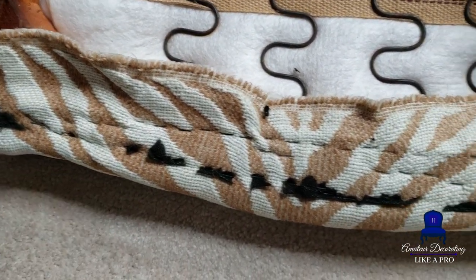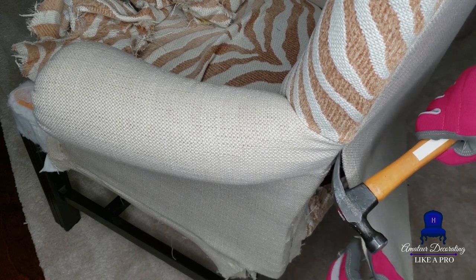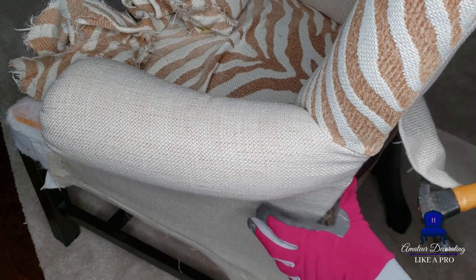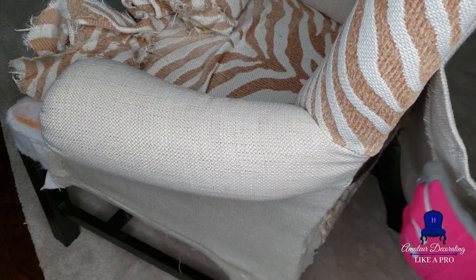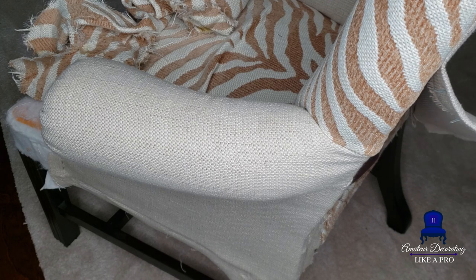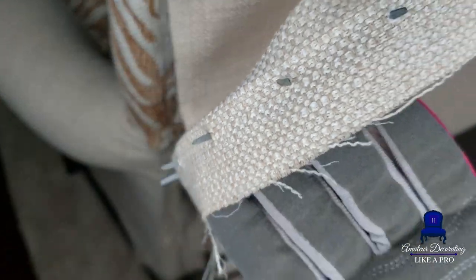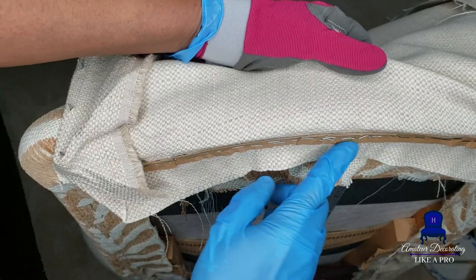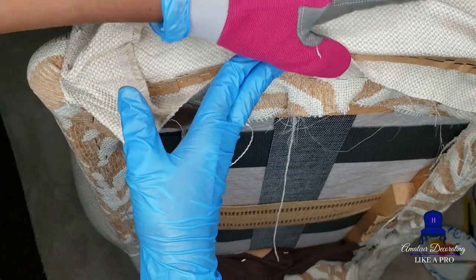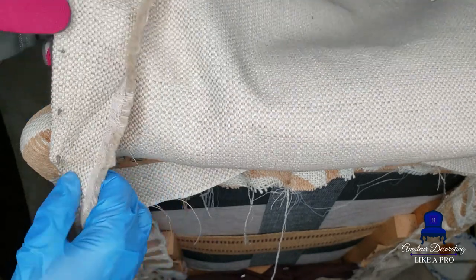I'm not using wood filler. I'm not a professional upholsterer. This is my project and this is how I am loving on it. Removing the back panel where there is tacking strip was pretty easy — you see how I am using the teeth of the hammer to pull that away. I'm also wearing gloves to make sure I don't scratch myself. This is the original tacking strip; you'll never find anything else made like it — what's being made now is very flimsy. This is cardboard stripping on the back of the chair. It gives you that nice, curved, crisp look at the top of your chair along the back, as well as underneath the arm of the chair, so that's how everything looks basically seamless.